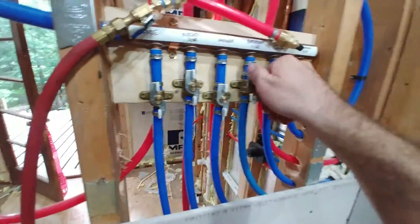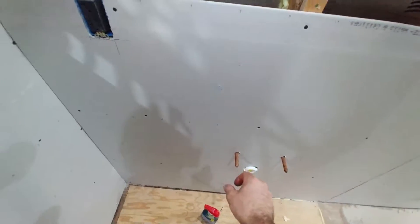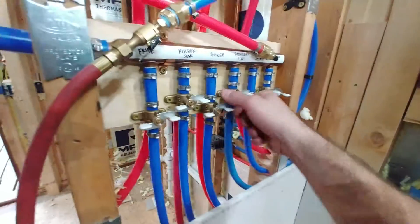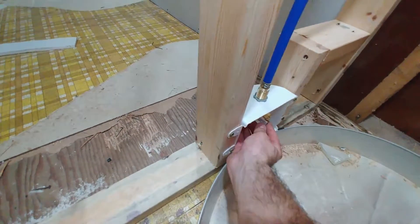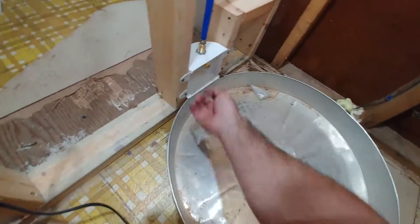I don't hear anything around here, and we'll do the same for the hot water. In the future when you come to close down for the season, the equipment won't be sealed - you'll open the valves and the faucet, and the way we've plumbed this, most of the water will run down to this point. You'll open that channel at the kitchen sink and water will shoot out until it's clear, then close that valve and move on to the next piece of equipment. For things like the refrigerator, you can just crack them open and it'll piddle water out into the hot water tank pan, which drains to the main gray water line.